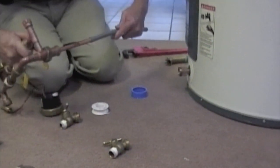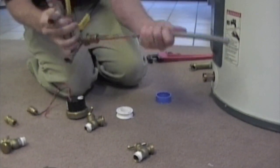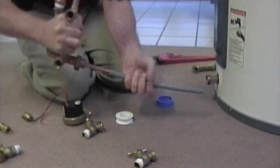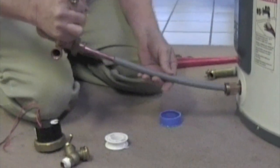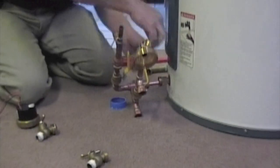The next thing to do is put in the copper onto the copper tube. You're going to be putting this gray tube and bringing it all the way in until it meets the black line that we provide for you to know when to stop. As you twist it in, make sure that it's tipped up as it goes in, so when the hot water returning from the collectors goes in it tends to aim up a little bit.